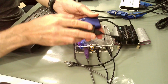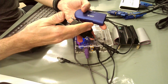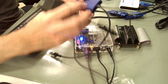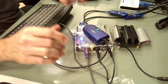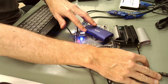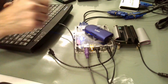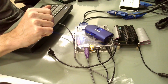The first step is, as soon as you receive your device, it comes with the factory default. I reset mine so you can see the standard configuration process. Of course, I will connect it to the power, and it's powered by 5 volts. You can use a standard P4 connection that comes with it, or the adapter that also comes with the device, to connect to a standard USB port.